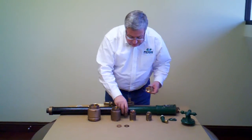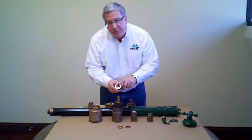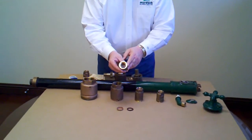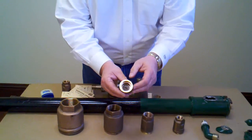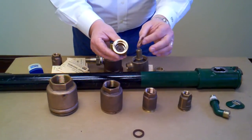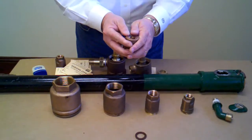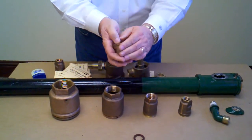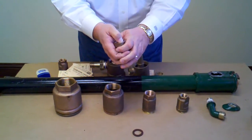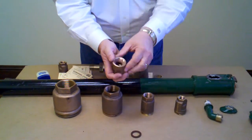To reinstall the new washers once you've cleaned out the orifices, you can reuse the same screw. Put the screw back in, put the tan side up so the screw is holding that seat washer in. Then take the beveled cup washer and put it in next — the bevel has to go all the way down. You can force it in with your fingers to push it all the way back down into the valve body. You don't want to take a sharp knife because you don't want to cut the edges. The new washers will sit right down in there, and the bevel has to point down into the cavity.